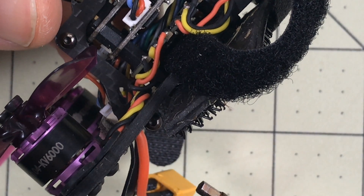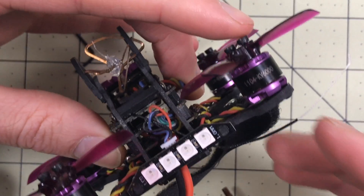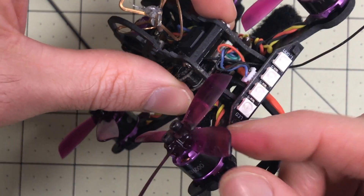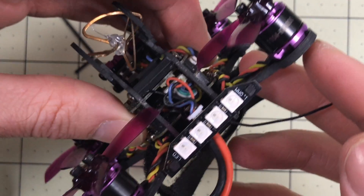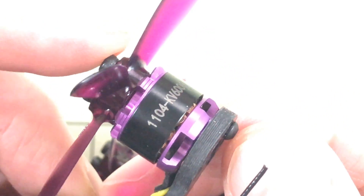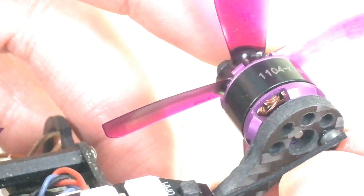The original screws are five millimeter, which should be okay. I've actually broken mine so I can show you what's happening. Most of mine have soft mounts and I've replaced the motors. But what's happening here is I've taken the soft mount out and I now have longer screws. This is a seven millimeter screw through my original frame into the motor without any soft mounts, and it is now contacting the copper inside the motor. See those windings? Those are what power runs through from your ESC.